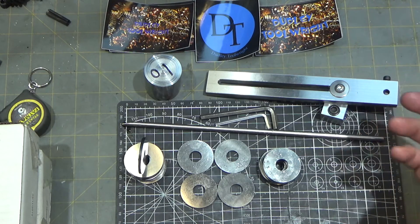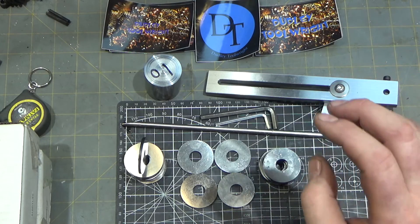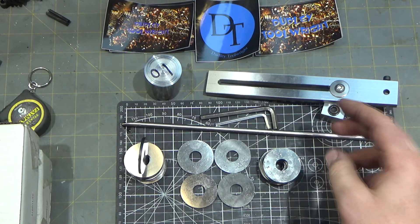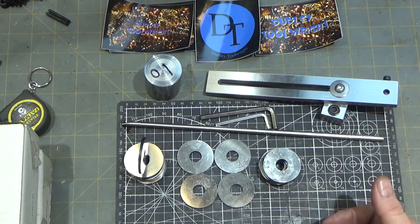Mr. Pisinski's tool — check the link for his video in the description; it's a very useful tool. I got more consistency toward the end as I learned to use it better and got the feel for the vibration on the probe. I was able to get within half a thousandth of thickness between cuts. When I started out it was within a couple thousandths, which isn't as good — it's just practice. I recommend the tool. Thanks for watching, hope you find it useful, and hope to see you next time.